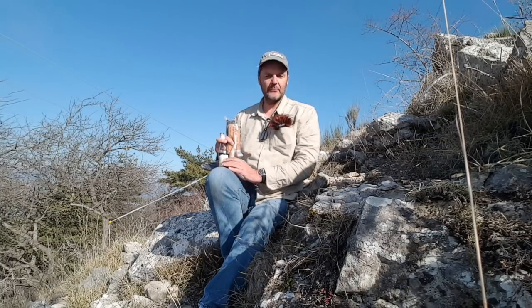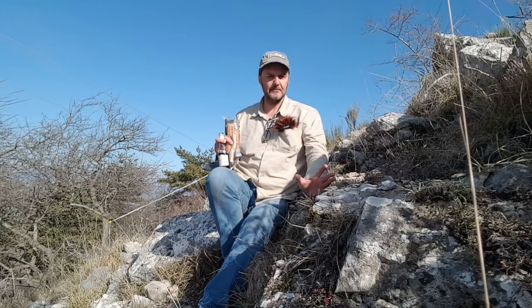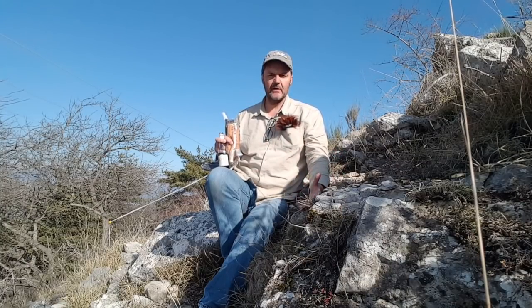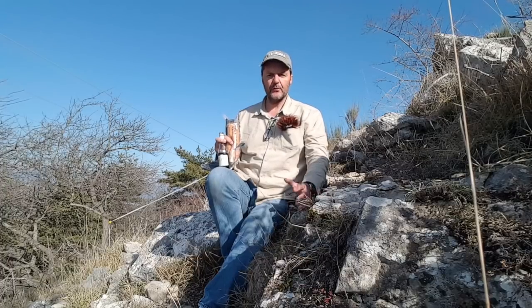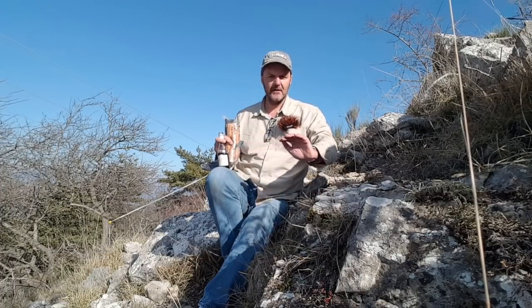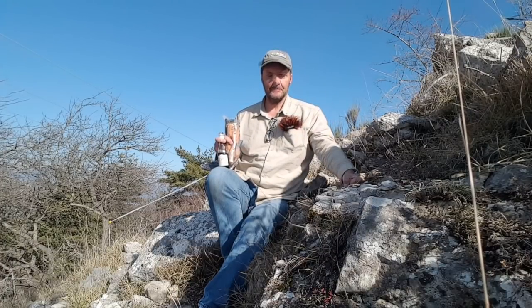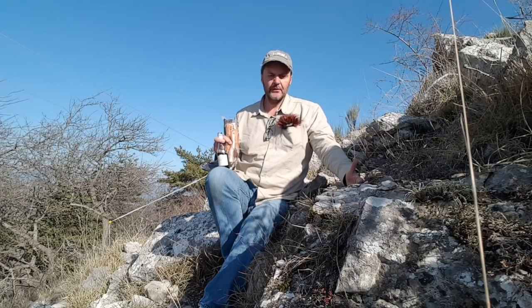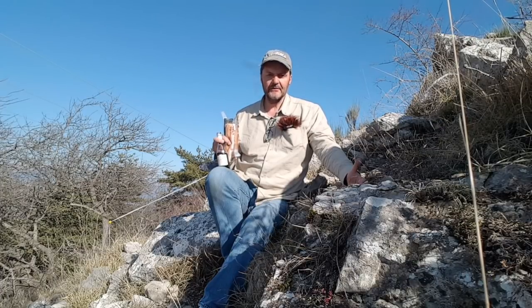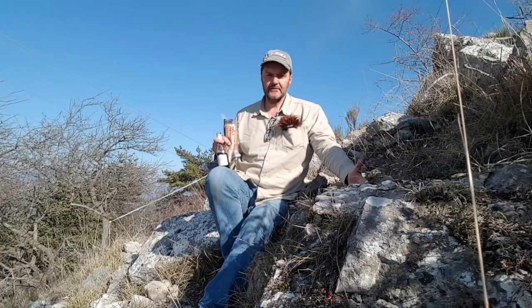What matters is that there is nothing between the two stations, basically. And here, I think what happened is that we got a tropospheric ducting between the sea itself and a temperature inversion a bit above. It does happen, not all the time, but it does happen. But even direct line of sight up to 100 miles does work quite often, and most of the time if you have the height.